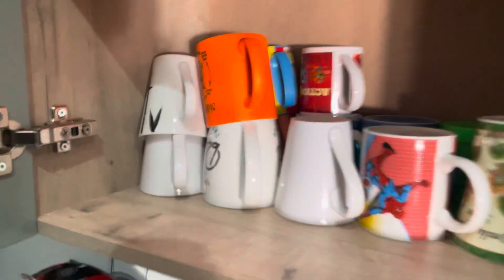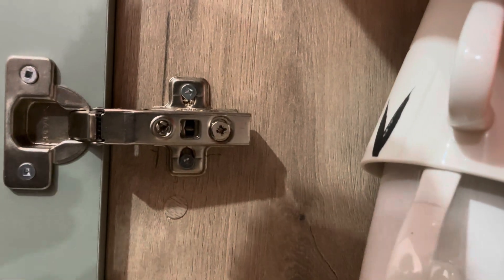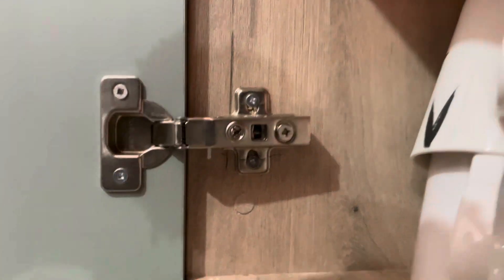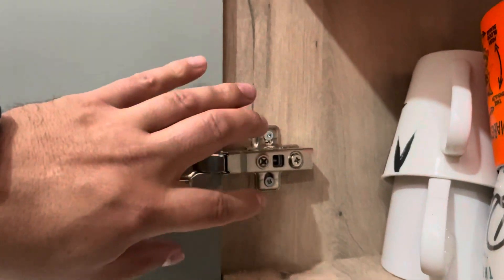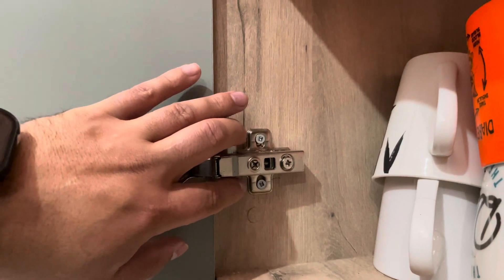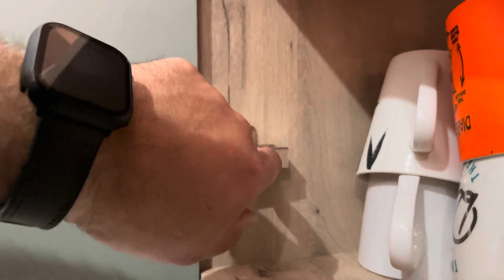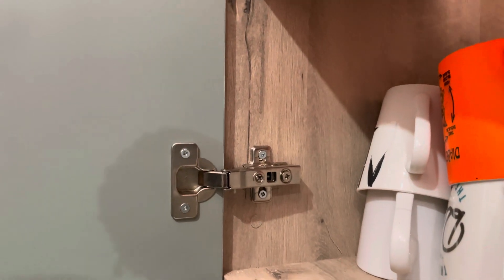Let me show you one more before I leave you. One more little pro tip: when you are done with this and you don't want this to happen again — I missed it the first time around. You will see on the inside of the hinge there is an extra hole. You can put a lock screw in that hole. Some of the hinges we use have a four-point base mounting plate, so you can put lock screws in there. And then some of them have the mounting plate inside. So fit your lock screws when you are done.